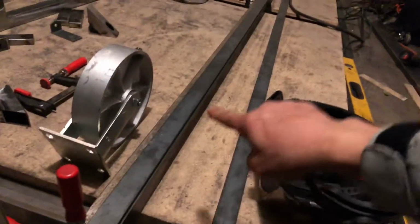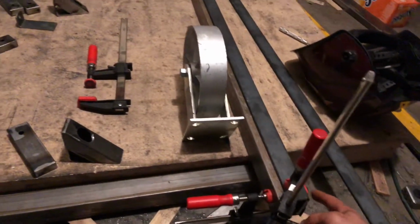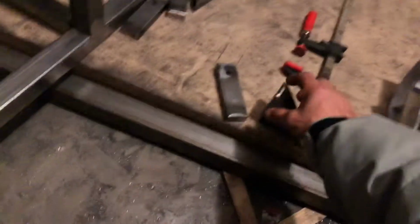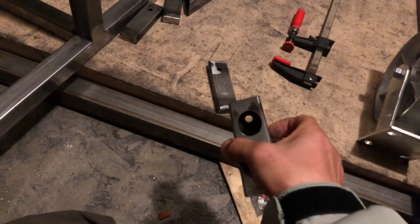But see, now this rail that this ladder sits on has got to be a continuous piece. So this is what I came up with. These are gonna mount to the bottom side of this beam, this bar right here. And then this guy is gonna be right here. See, you follow me? So if this is there and that's there, then the rail can sit right on top of that. And then we can have some studs welded on the bottom side of the track here. And the studs will line up with those holes that I can get back in there and tighten the nut with.